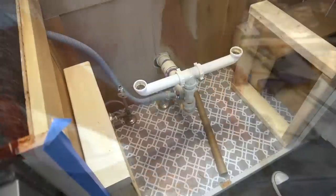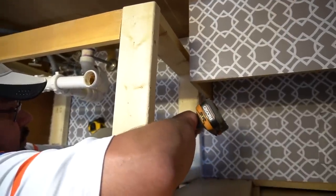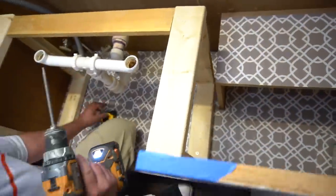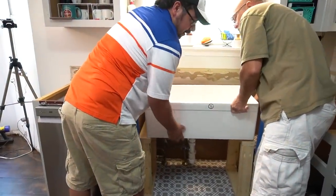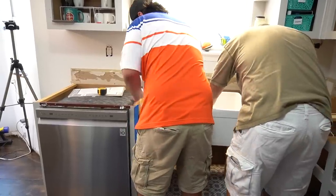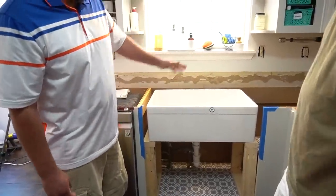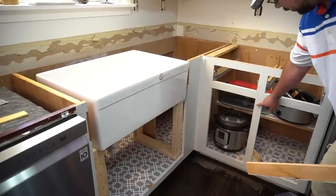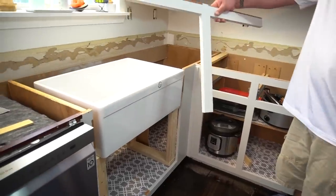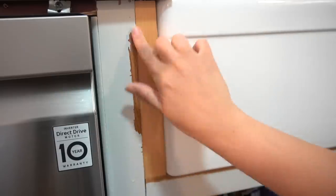Nelson used a Kreg jig and made some pocket holes in order to create the two large frames that you see right there. He added another piece of wood in between them to keep them steady and then installed them directly onto the inside of the cabinets. Then it was time to put in the farmhouse sink and see if it worked. Of course, the farmhouse sink was smaller than the opening, so we were going to have to figure that out and fill those spaces in as well. A quick tip if you're mounting a farmhouse sink: make sure you save the little trim piece underneath. We carefully took it off so we could cut it down and put it back. Next we added a couple of pieces of wood on either side of the sink between the sink and the original cabinet face.